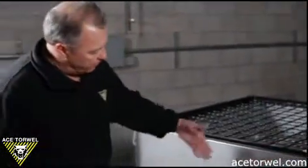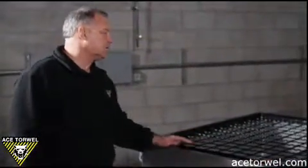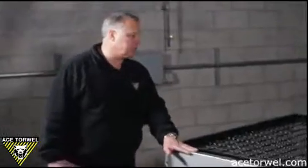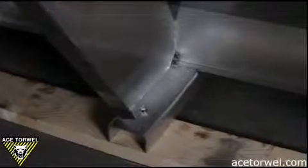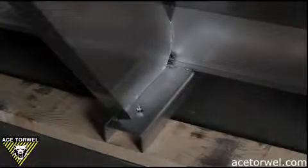Each side is formed in a single sheet of stainless steel — in this case 304 — and formed with a 45 degree angle to allow free flow of the material to the chain, supported by a minimum of three gussets welded to the hopper body and to the form base channels. All of our hoppers are fully welded on the outside seams and structural bends are put in to stiffen the body of the hopper itself.